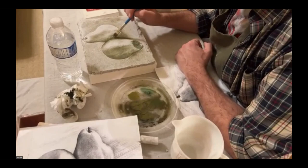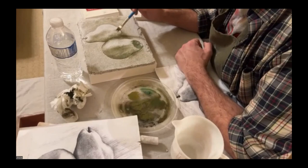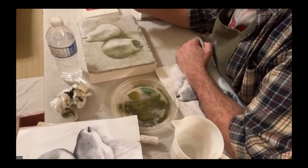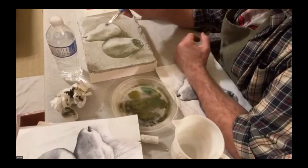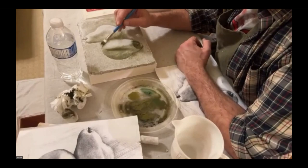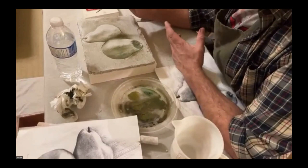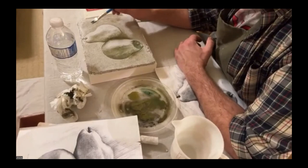And if you've ever heard the expression cycle of frescoes, that's where the term comes from. A cycle of fresco means that quicklime comes from burned limestone. Limestone that's been burned in a kiln becomes quicklime. Quicklime that's subjected to water then becomes hydrated lime. Hydrated lime putty that's mixed with sand becomes lime plaster. Once the plaster is put on a wall and it oxidizes and dries, it's, once again, limestone.